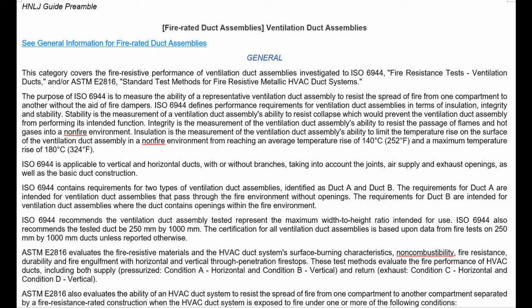So it's in the protected area, not inside the duct itself, where you may wish to keep the air that you're pressing into your egress routes and areas of refuge, where you may feel like it's a good idea to keep that air cool and to keep the fan operational. We're not testing there. There's no thermocoupling there.